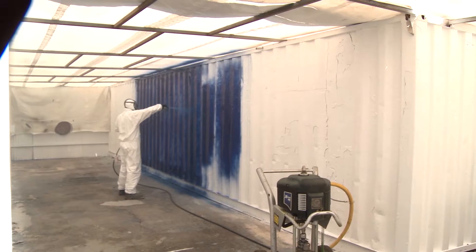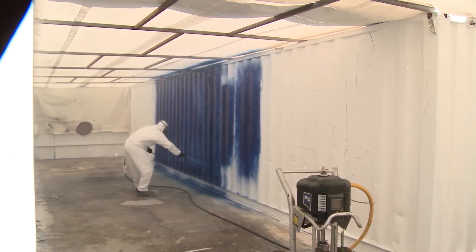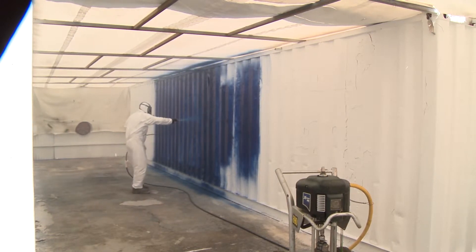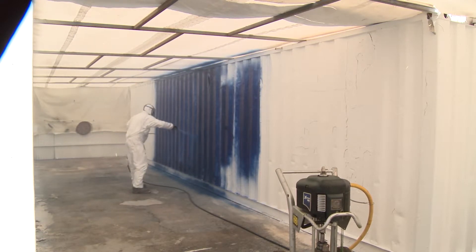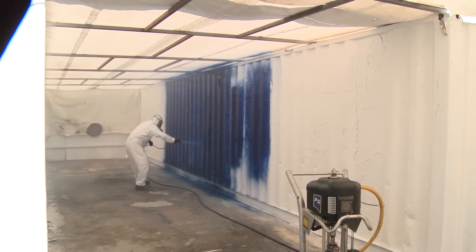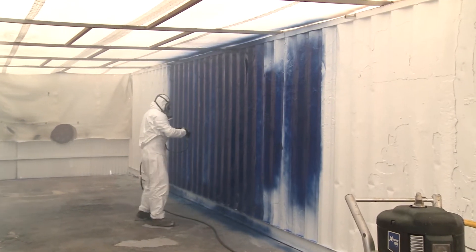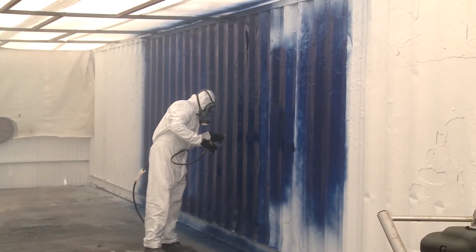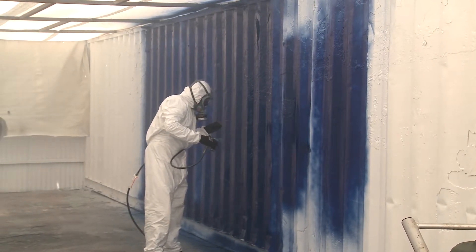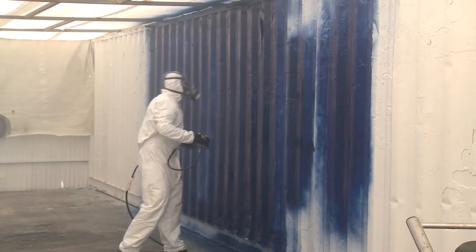Sam has left this for 10 minutes to flash — you can see his actions are a lot slower. What that enables us to do is apply another coat over a sparse coating and achieve coverage. Sam will check his wet film thickness now to ensure he's got the appropriate amount of paint in conjunction with spec and data. Using his wet film comb, he'll push it into the surface and make sure he's got the 50 microns we're looking for.